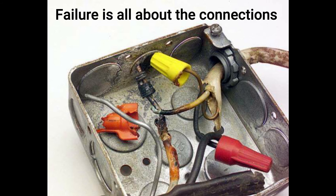Wire nuts are not compatible with aluminum wire. Although you can buy special wire nuts with a deoxidizer agent added, I don't recommend them. Aluminum wire is more brittle than copper wire. Wire nuts have a sharp coiled wire inside them that score the wire as they are screwed on. This scoring on aluminum wire can cause it to break off.